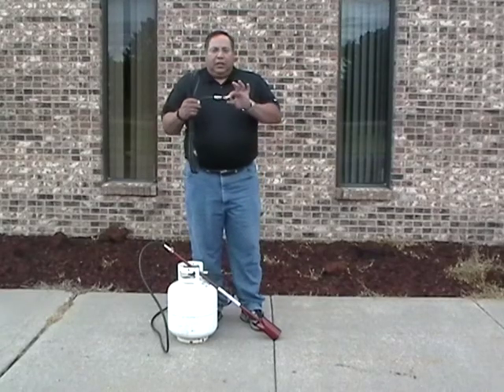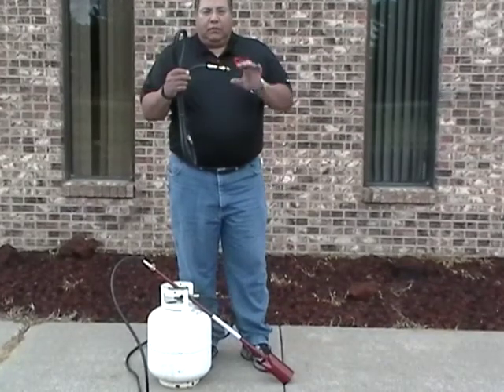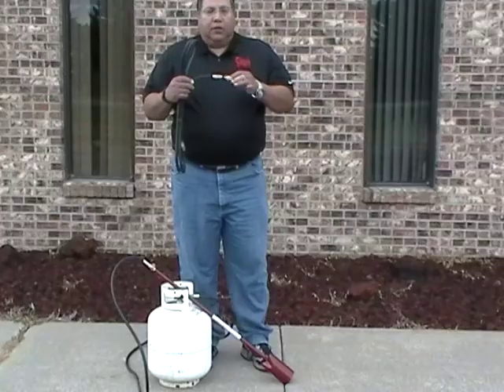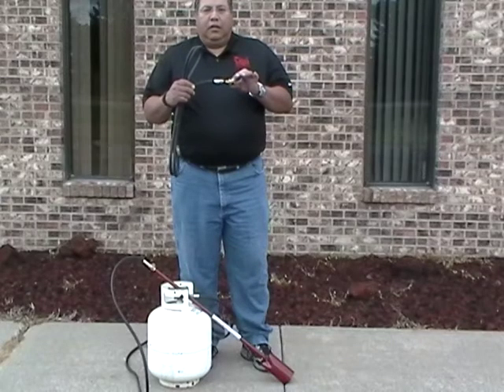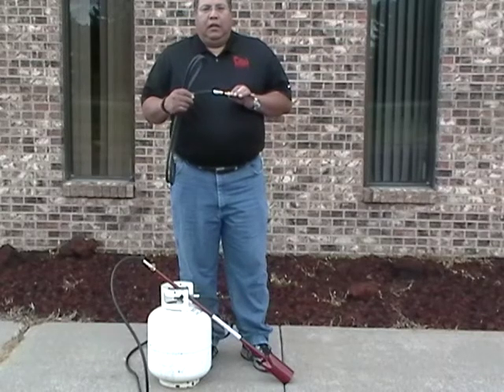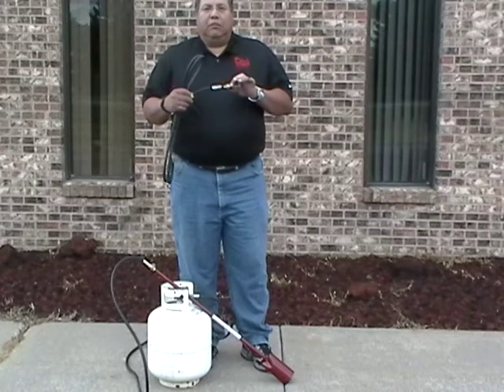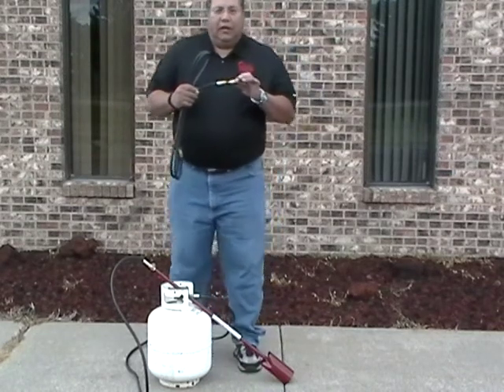In the POL, which is the end that goes inside the propane tank with left-handed threads, there is a check valve — an excess flow valve — which, when checked, will shut off 95% of the flow. It can be easily reset, and I will show you how to do that. That's what causes the weak and lazy flame.